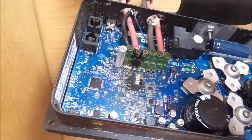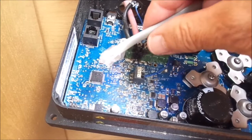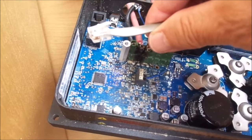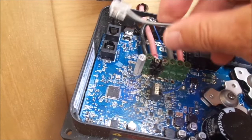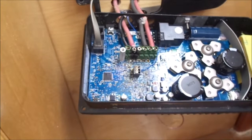I'm going to be hooking up the synchronization cable. This is a six-conductor RJ-12 — what some call a telephone cable. Be careful when you go to buy one of these: do not buy a four-position cable. You need a six-position cable. Four-position are the typical telephone cables, but you need a six-position data cable. It snaps in place right here, and it will also have to be connected into the other controller.